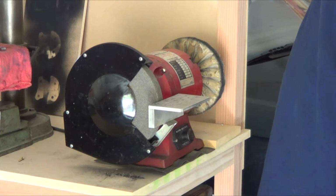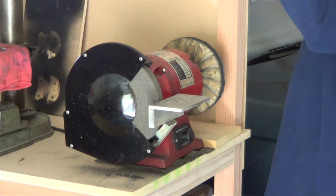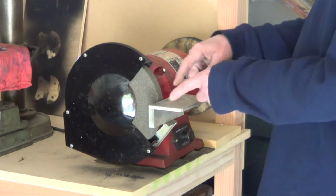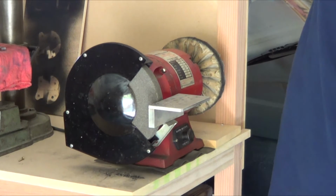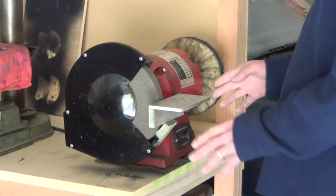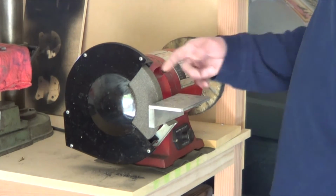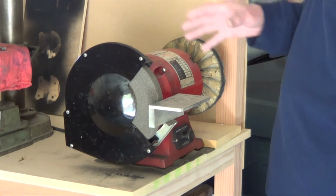So I wanted to do the cutters, high-speed steel cutters. I was able to do all of them so far on here that you've seen, but I made this little mini kind of pallet, all holes threaded, so I could use the clamps off the mini pallet. Problem is, it just moves too much, which is a real pain. And I did see a video where a guy ran just a plate from platform to platform, and it was rock solid. But since I use a buffer, I don't have this piece to put on this side to put the two pieces in there.